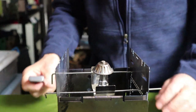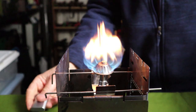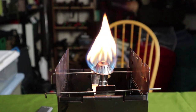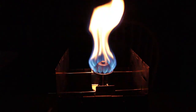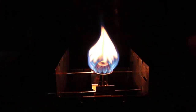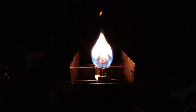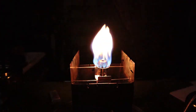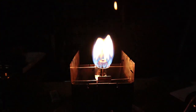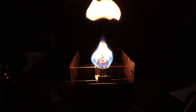I've reduced all but one light in the room. I'll light it up and then turn the last light out so you can see what this looks like. In the monitor it still looks as if the flame is quite bluish-white, but in reality the flame is yellow — right now it's like a candle flame, much more yellow, which means a more incomplete or less efficient burn of the fuel.